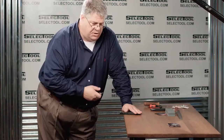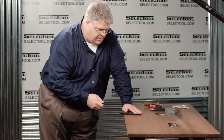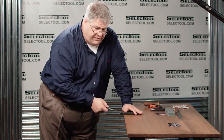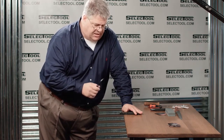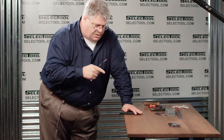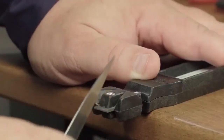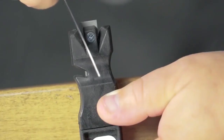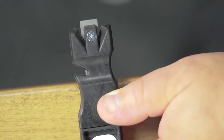Like for a stone, you normally are grinding the little rough metal off into powder. You don't really see it. With this tool, you will see little shavings, and that's just like when you go to a machine lathe in a metal shop. You see that spinning metal, and that metal bit hits that spinning metal and shears off the little curls. So that's what you're going to see on there. When the knife is kind of rough or dull or misaligned, then this tool will find the dullness and shear. That's the term. It shears into these little shavings.